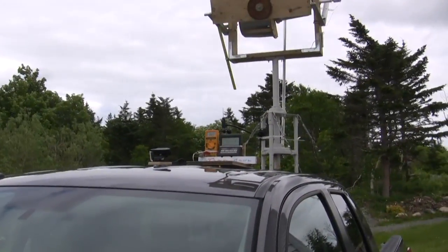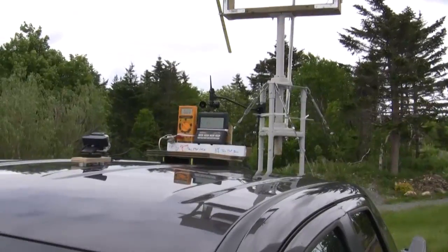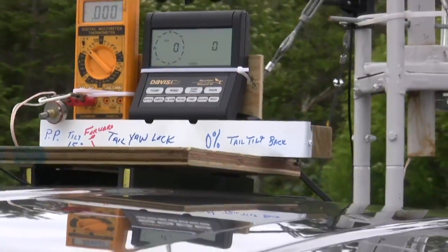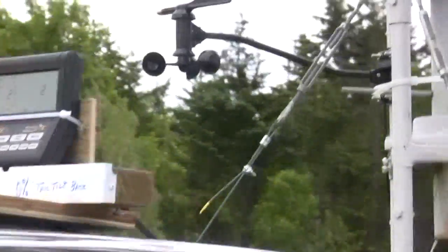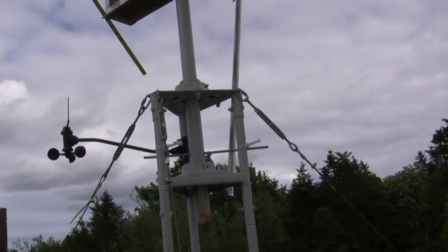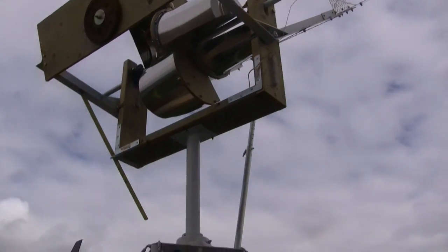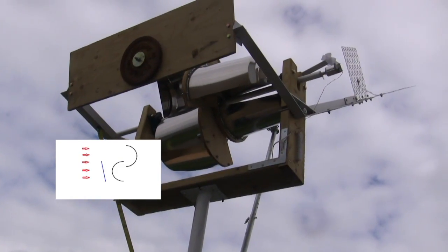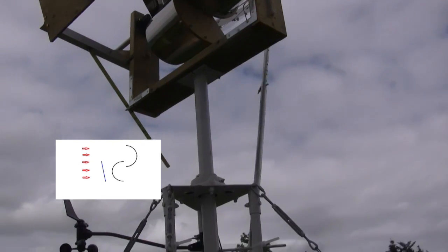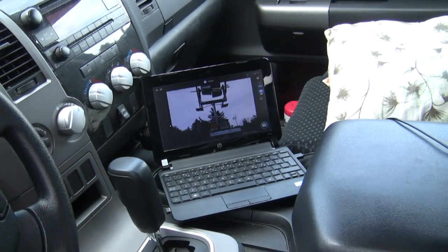I have my instrumentation in place. This test will have the power plate tilted forward at about 15 degrees, the yaw is locked in place so the turbine can't yaw, the tail is locked at zero degrees tilt. I hope to do a test at zero, fifty, and one hundred percent tilt back, looking while driving at my live view camera right here.